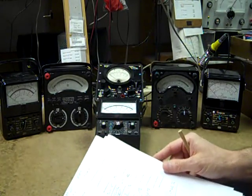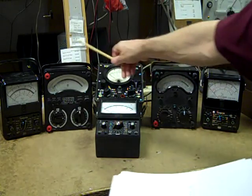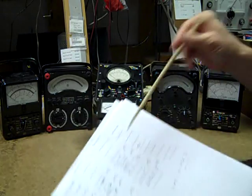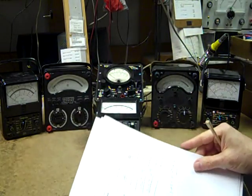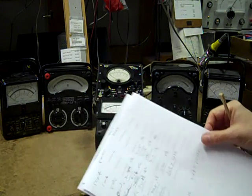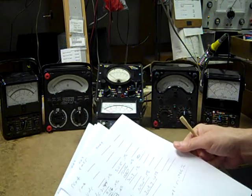The second best would probably be the AVO 8 Mark V, with average accuracy all through the 300-volt range of 0.326%. It's spec'd at 2%, but even if it was spec'd at 1%, it would beat that by a wide margin.